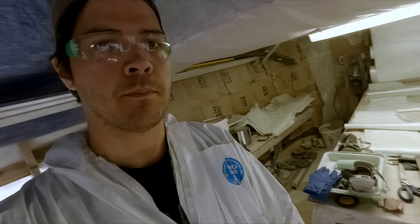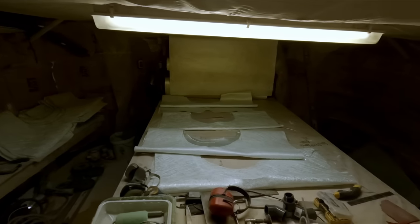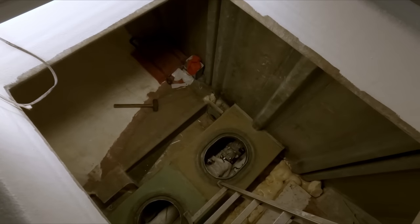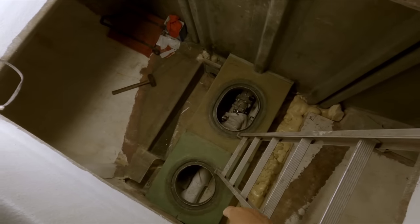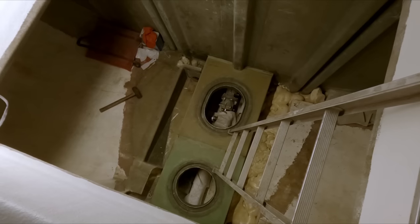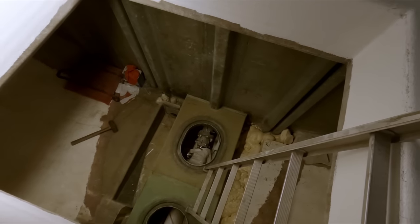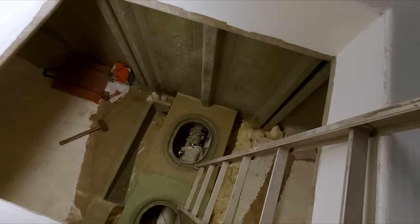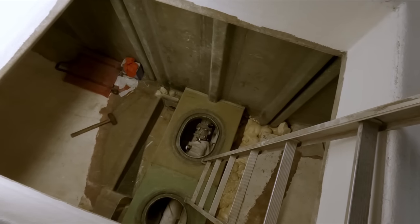All right, everyone. Well, about to get rolling on the big lamination. You can see we have all our pieces cut up here, and those are gonna be laminated to our shaft alley covers down here. They're all prepped and ready. Got our knife edge started, I guess. Need to bulk up the actual knife edge a little bit, but got all that laminated anyways, the channel piece. So it's all cleaned, edges are puttied, ready to receive some cloth. So we'll get rolling on her here, and that'll be quite an exciting day to have that done.